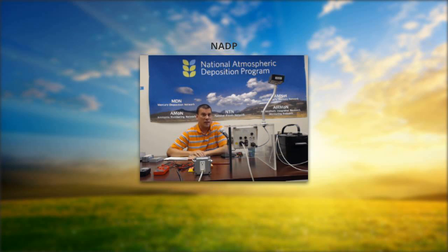Thanks to Jeffrey for letting me be on screen, because I get to give Jeffrey tasks today as we troubleshoot our setup using a couple of tools. The first thing we're going to do is troubleshoot the AC line voltage that comes into your site. We stop at the outlet — if you have conditions at the line power, the incoming 120-volt nominal voltage, we'll have to refer you to an electrician. But we will tell you how to troubleshoot incoming power issues.